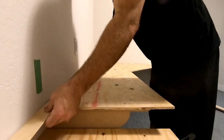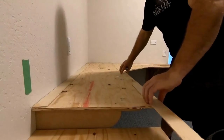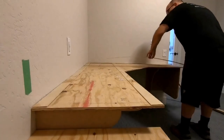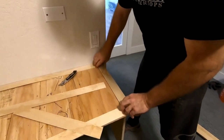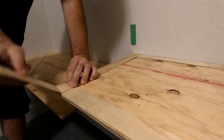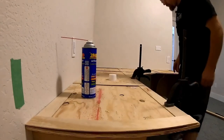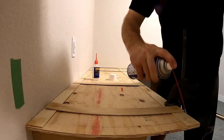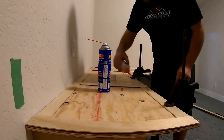Welcome to our job site. The first thing we do is run our template material against the long walls and front edges first. We score it a couple of times and snap the template material, leaving it a little shy so pieces don't overhang where we don't want them. We follow the perimeter and do the short ends last. Using 2P10 glue and accelerator, we add a couple daubs of glue, a couple daubs of accelerator, hold it down for about 10 seconds — and voila, a joint that's not going to come apart.